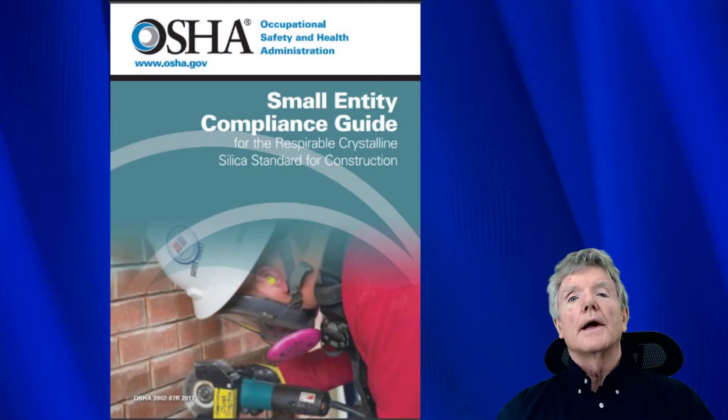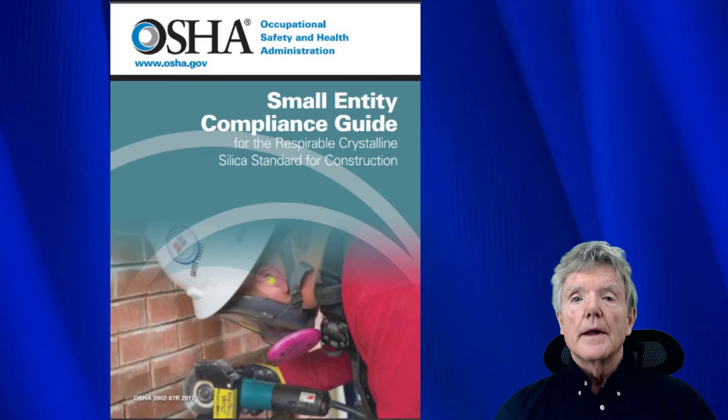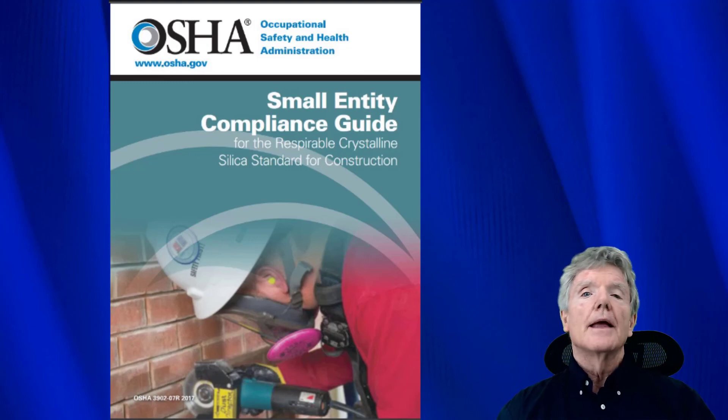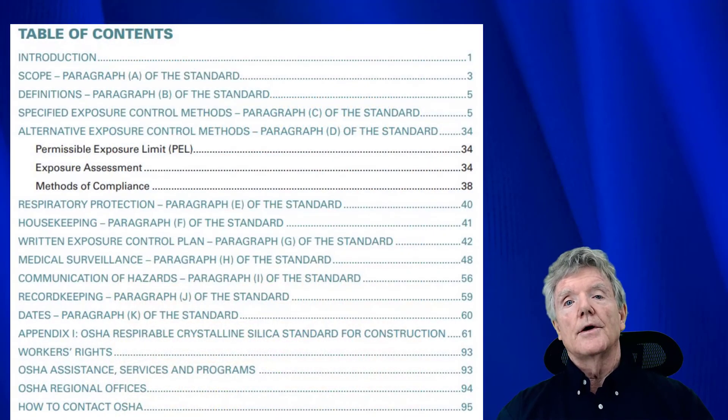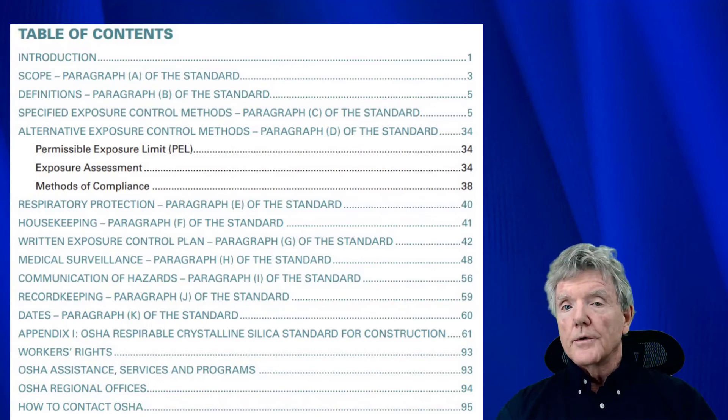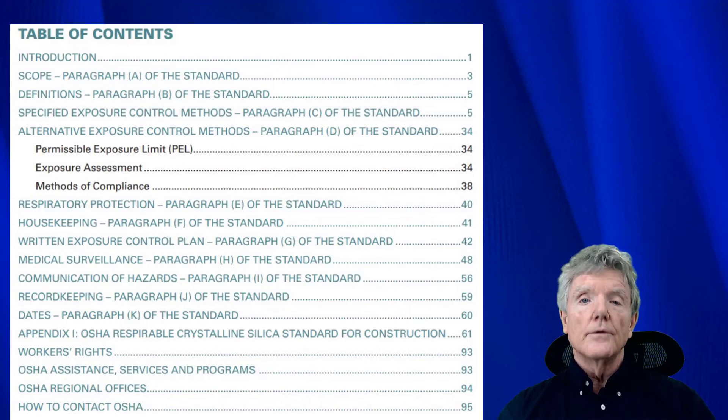None of the guidelines make it clear that if you blow the dust out without some kind of protection, you can really make yourself or other people sick. There are a lot of regulations OSHA has set in place, but the problem is this booklet on how to do it is 95 pages long, and not many contractors are going to work through all that record-keeping. From a contractor and safety point of view, using the vacuum system is much easier and much safer.